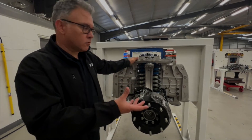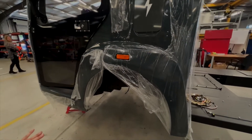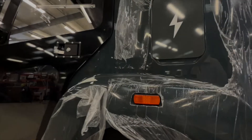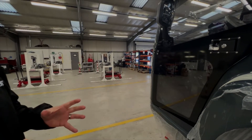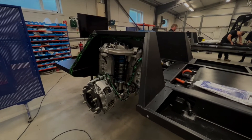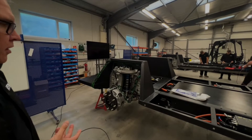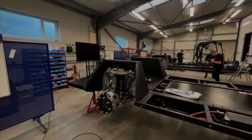We'll move on in a bit and I'll show you the trucks. In October we're taking this to the next level — the C-sample — so taking up a level of our development. On the side here you can see the corner zone, and you can see that the corner bolts directly onto the chassis as a contained unit. We can actually take that corner on and off within one hour, so the whole corner itself can be serviced as an independent single part item. That corner is actually developed for 350,000 kilometers, so it's robust and durable — built for purpose. This corner is full of sensors because we're going to be running this vehicle over the next three to four months here at MIRA to collect road load data, to understand how the corner is being stressed — all the strains on it — and we can then take that data back to our CAE to make sure we've optimized it. We'll also be doing a lot of durability testing with this vehicle.